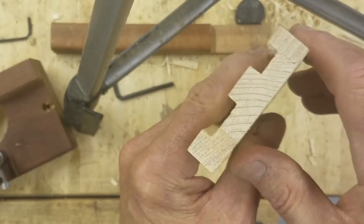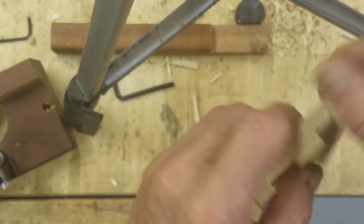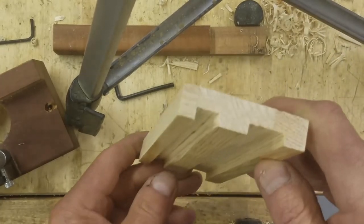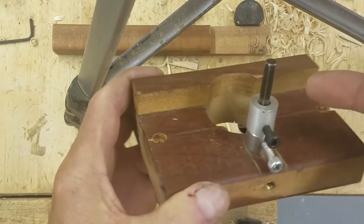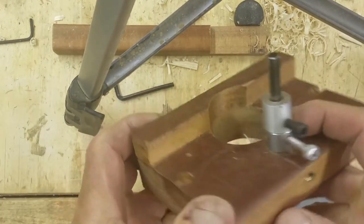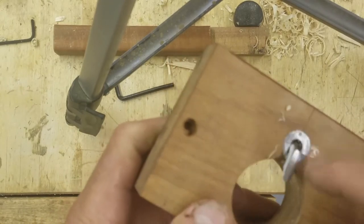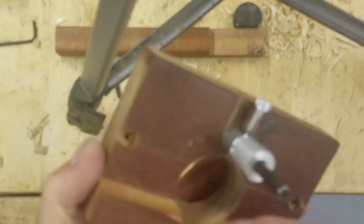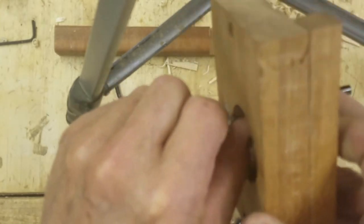You can see, made a pretty nice dado. I'm pretty satisfied with the tool. Simple frame, a bit holder that has one operation to cut on. I cut this on my mini mill. Allen wrench, simply ground on my grinder, a stop collar, and a couple of set screws, and you have yourself a pretty nice router plane.